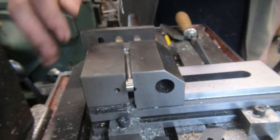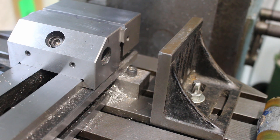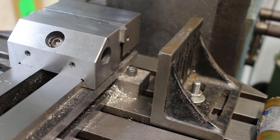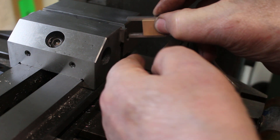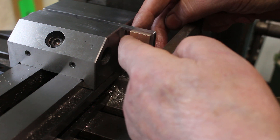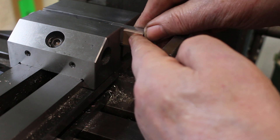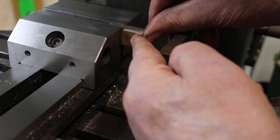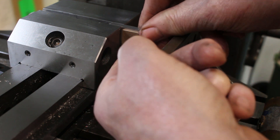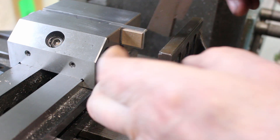We're at the Deckel mill and I've got the connecting rod held in the vice, set parallel to the bottom face of the vice. I've got the bearing block fitted into the strap, and because this strap is a good fit — slightly smaller than the width of the connecting rod — it's a good fit in there giving the alignment. There's virtually no sideways play; push it in tight and that's it in position. To keep that in position I'm using the adjustable parallels.